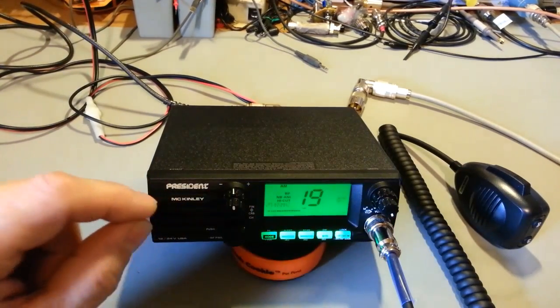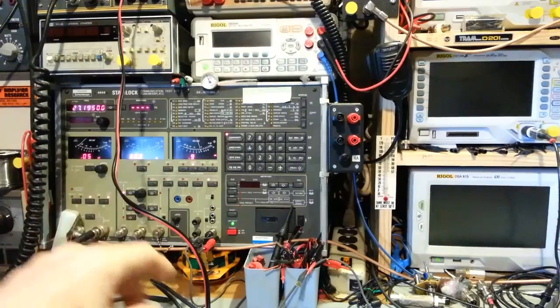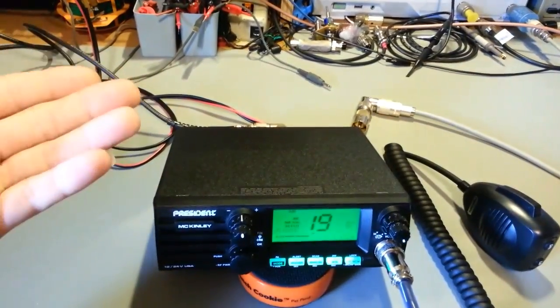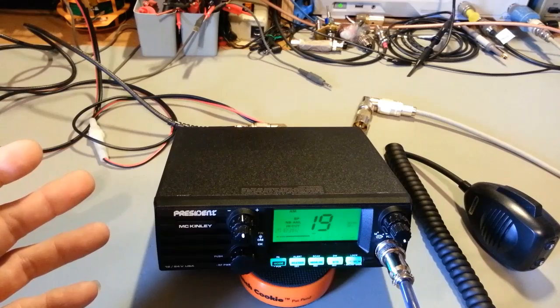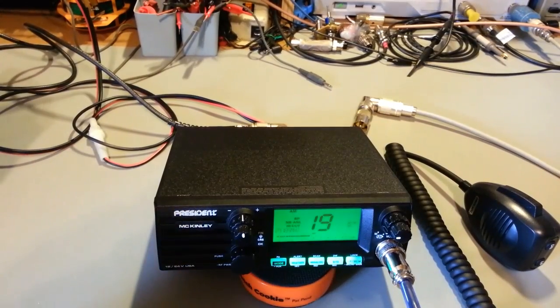You can hear the amount of static there. Now what I'm going to do is change that to 1 millivolt output. So amplitude, 1 millivolt, and listen to the sound change. Now, I know you can hear the pickup in static, but I can also hear a tone. I don't know if that's going to show up in the camera or the video or not, but I'm sitting here listening. I can hear that 30% modulation at 1 kilohertz tone. That's only 1 millivolt. Don't get me wrong, that is a booming signal, but